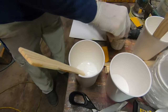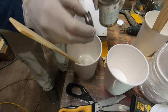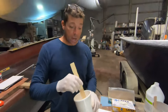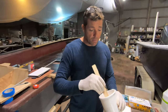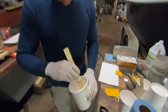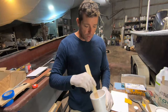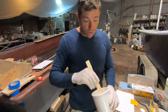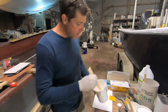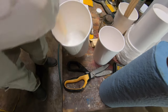We're adding about a capful of modifier C to the gel coat. That's a sanding aid or additive that keeps the gel coat from being air inhibited — gel coat actually needs a film on the surface to cure properly. Sometimes gel coat comes with sanding aid or wax added already; I prefer to get gel coat without wax and add it as needed. On our thickened gel coat with colloidal silica we did not have any wax — that's very important — but on the finish top layer we want the wax. You can even use wax paper as a barrier film if you don't have modifier C.